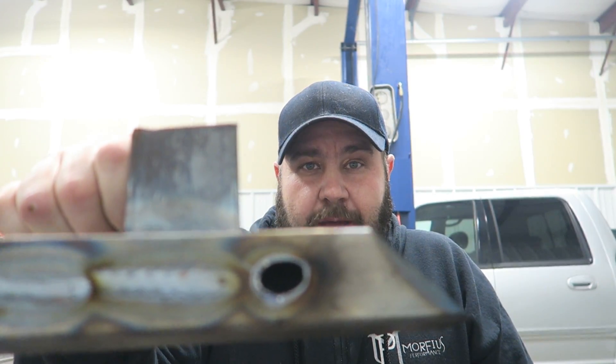Those are your two most important aspects of MIG welding: number one, voltage according to the material you are welding, and two, wire speed. Those two are very closely matched and you need to get them right depending on what size and thickness of metal you're welding. You guys saw on this piece here - see that big hole we blew in there - too much voltage on thin material. And you heard that hiss when the wire speed was too slow - that's the wire melting before it gets a chance to go into the actual metal itself, so your weld is going to be garbage.